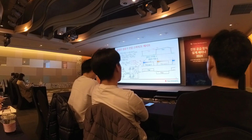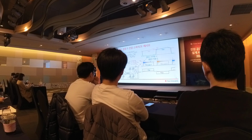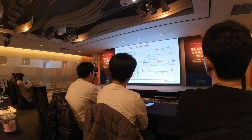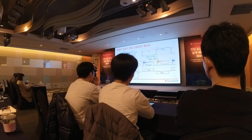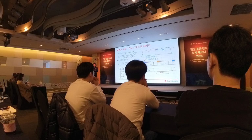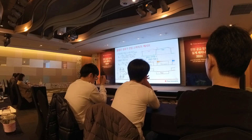The first try, and probably the most general usage, is the passive snubber. Basically, you can add an RCD snubber connected at the front of the output inductor, between the output and the ground. So the SR rectifier output voltage will be clamped through the diode to this capacitor voltage. How high the capacitor voltage will be depends on this resistor value. The resistor value and the power dissipated on that resistor can be calculated through this equation.